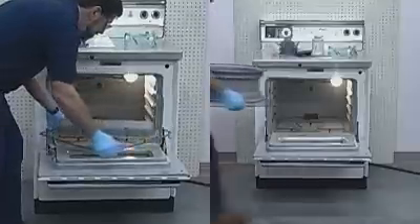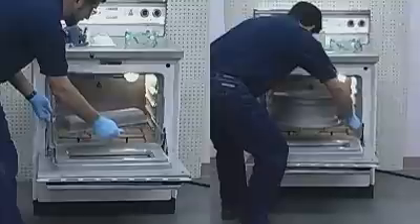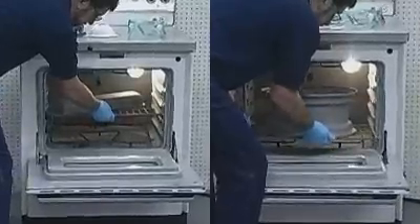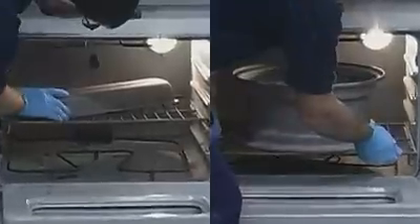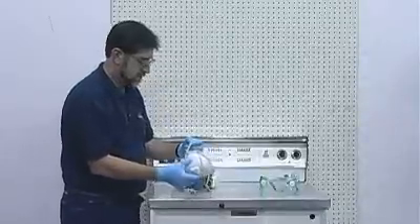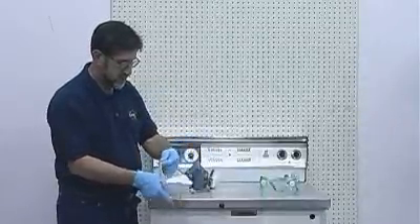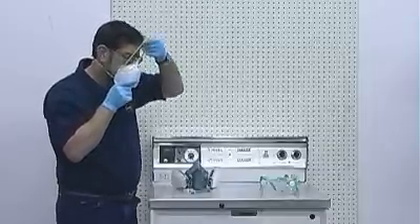Hang the part and practice sliding the rack in the oven without disturbing the powder coated surface. Uncured powder is held in place by static attraction and can be easily removed. Parts can often be positioned on or suspended from an oven rack. Be sure to turn the oven rack so that it is not required to remove or install the rack. Hot coat powder is not solvent based and is environmentally friendly. Although the hot coat system is very safe to use, appropriate eye and respiratory protection should always be worn.